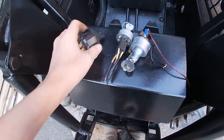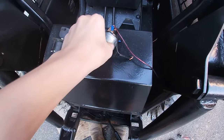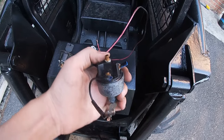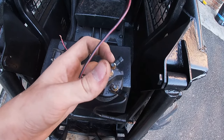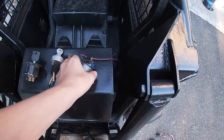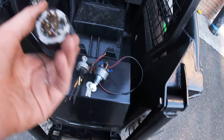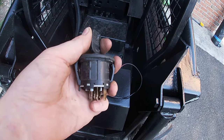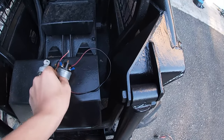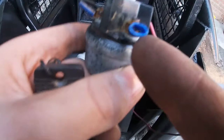All right, so here's the deal with the switches. This is the broken one, I think. This is the one that the guy tried to wire in, but this one gives power to ignition when the key is on. And you want it to give ground. So this key switch wouldn't work for this engine. This one grounds the ignition when the key's off. Right, so this one, there's nothing going to ignition when the key's off, but we want it to be grounded. Instead, this one goes power.